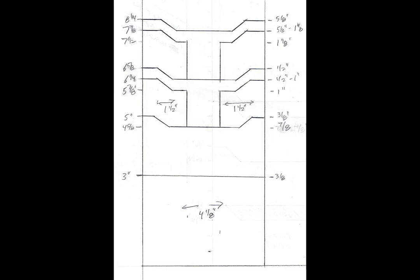And when you transpose these, be very careful. The tabs are an inch and a half in from the sides. And there's only two tabs you have to worry about. And the width of these is 4 1/8 inches as shown. When you do this, you have to do two of them. There's a left and a right, and you're going to see it in the video. Keep them apart just in case there's a slight difference in width. When you cut the left, keep them off to the left side. When you cut the right, keep them off to the right side.